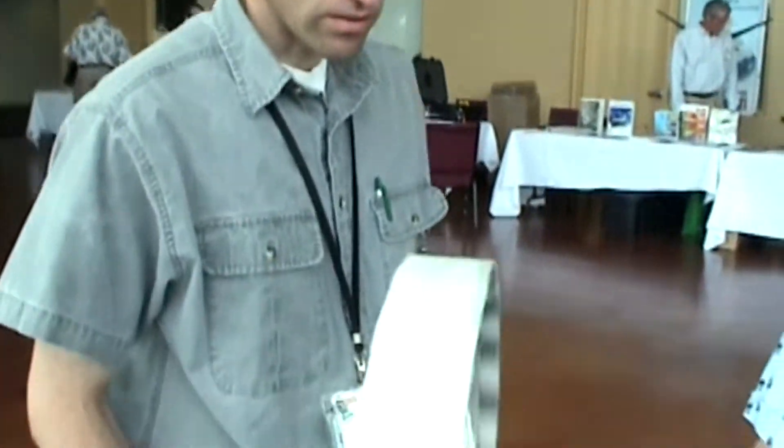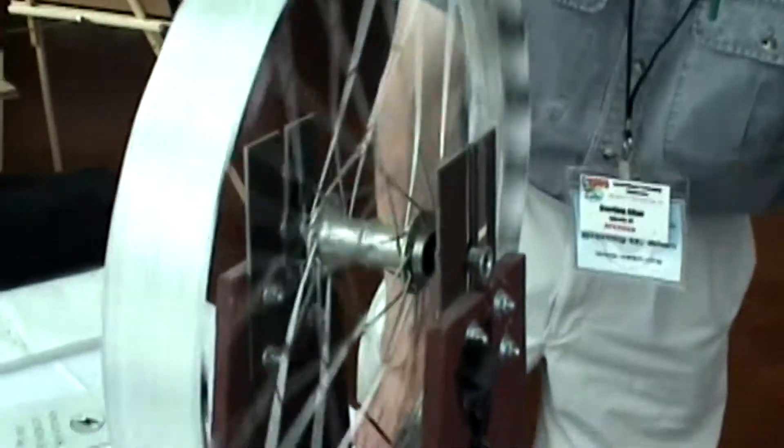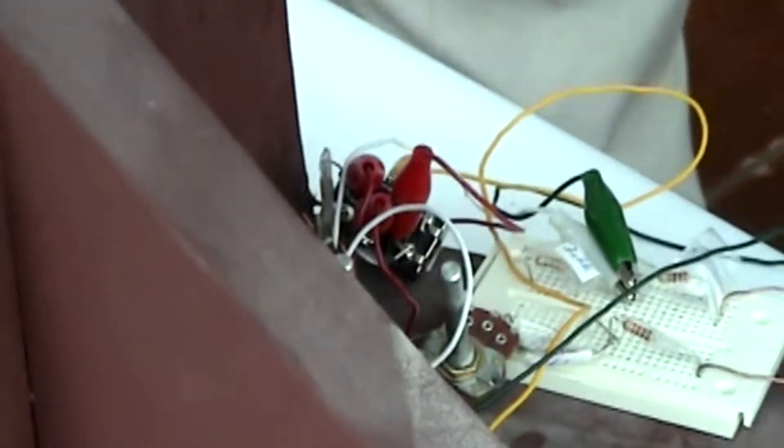So which is your adjuster — this one? This is a 10K, 5K, and 25 ohms, and so this is my fine tune, then I just hardwire some resistors in here. This is just a breadboard, so you can switch whatever resistors you want. So I can go plus or minus 100 with this, and this will go up to like 20,000 or something like that.